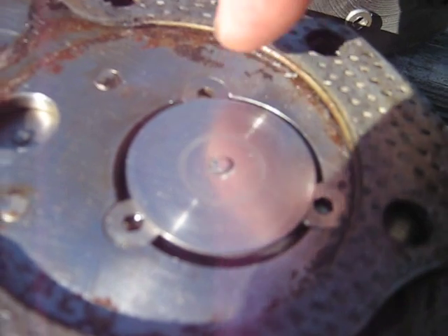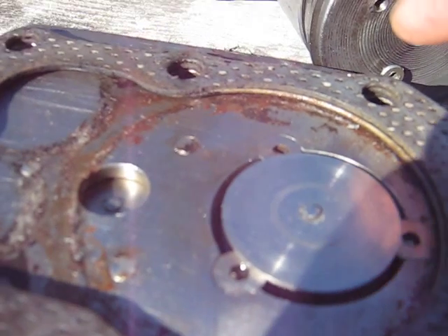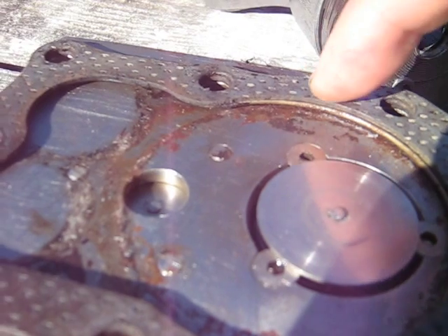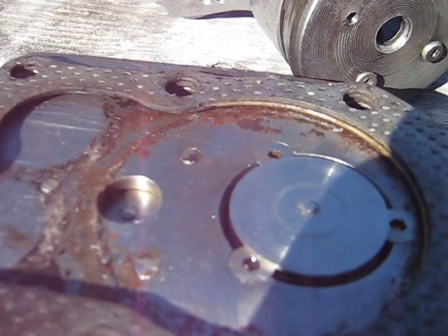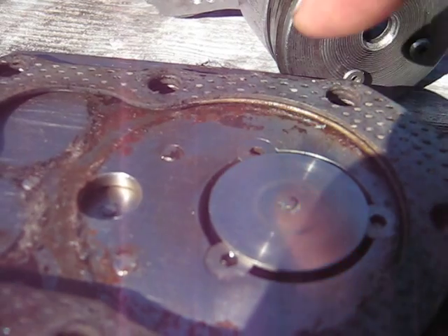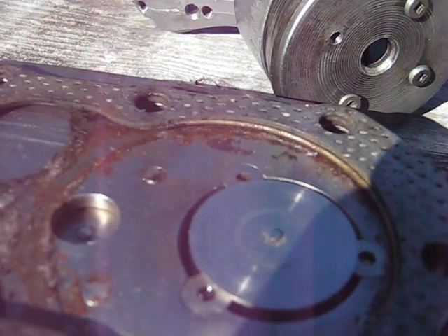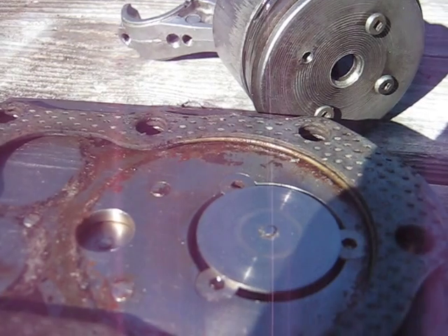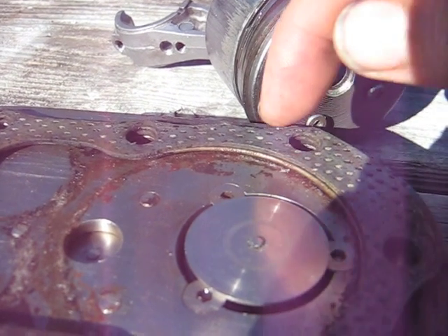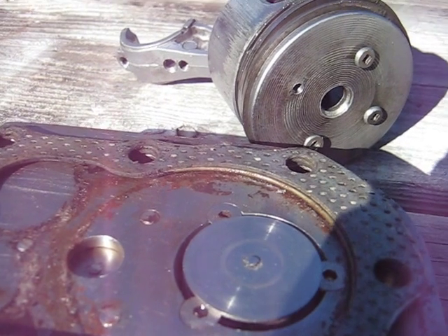Your screws will sit above that. So what I suggest is using two head gaskets to gain the room that you need, because the piston comes right up here. You could also grind little notches in the piston if you needed to, but what I would suggest is to bolt a piece of — probably under eighth-inch aluminum — to the top of the piston.